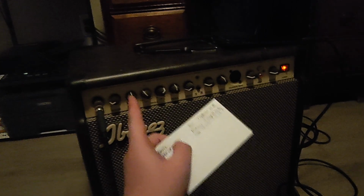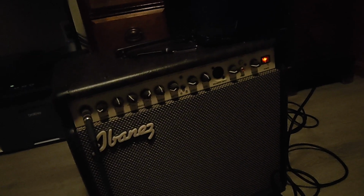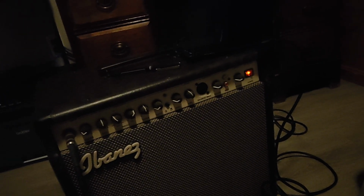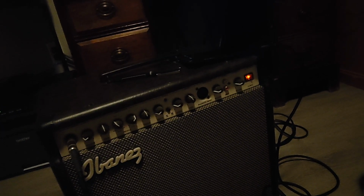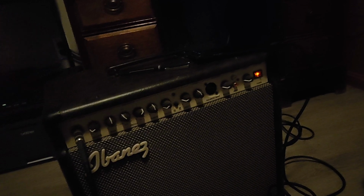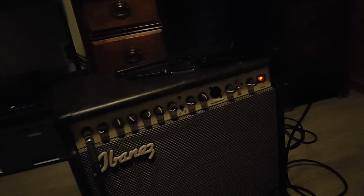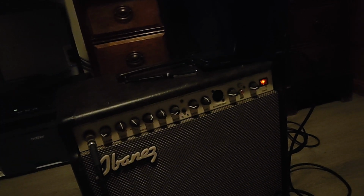First being the bass level. Now I pre-recorded what the original settings were so I can return back to nominal. The bass level is supposed to provide amplification of plus or minus 15 decibels at 70 hertz or less. So with a 70 hertz or less signal injected into here, I should be able to decrease it and see that 15 dB drop approximately, I would assume. Increase it and see a 15 dB gain.